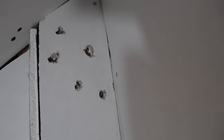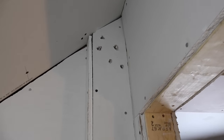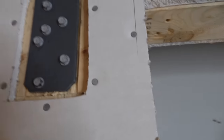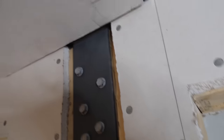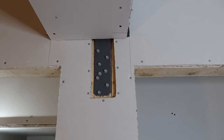There was also one in behind here and I just chose to drill holes where the bolts were. There's a little hump in the wall — you can see from the gaps — but it's in a closet so it'll get straightened out with corner bead. And this one, even though they made an attempt to recess it, it wasn't quite enough so I decided to just hack out the drywall there.